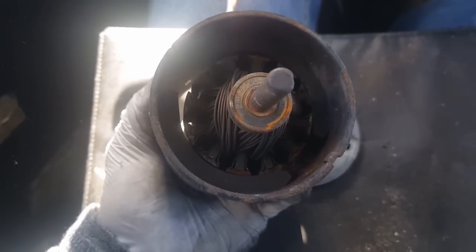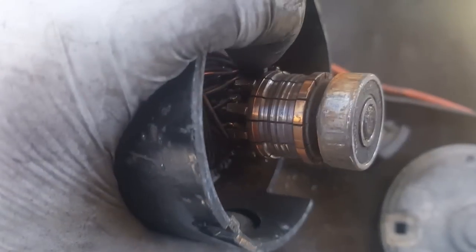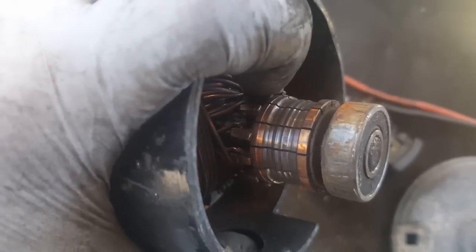Okay, this thing is just in a magnetic case, magneto, whatever. And you just push it out, because the magnet is actually what's holding everything together. There's no more clips. Oh, here come the brushes. Those little brushes, you just feed them back in with the spring. You might have to use a little paper clip, just like when you're doing a starter. Okay, you can see it's a little worn. So I'll probably just sand that down a little bit and flip the brushes around, and away we go.